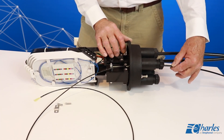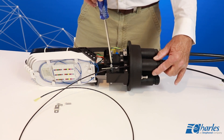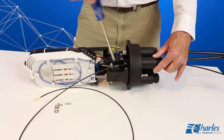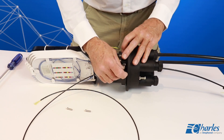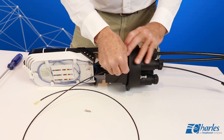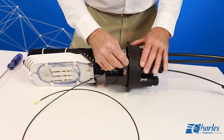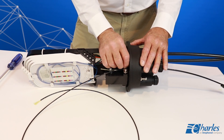The FODC base has attachment plates and strength member brackets on the sides, similar to those shown for feed cable installation. Use the set screws and the strength member brackets to secure the branch cable. Tighten the branch port screw. Use the included wrench and tighten as much as will easily tighten. Note that some grommets have multiple openings for multiple cables depending on the cable size.